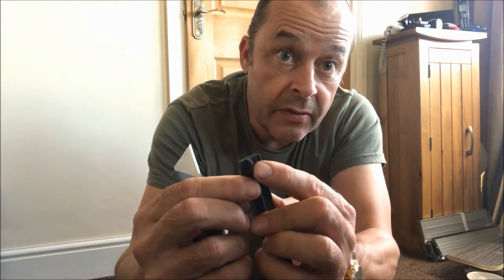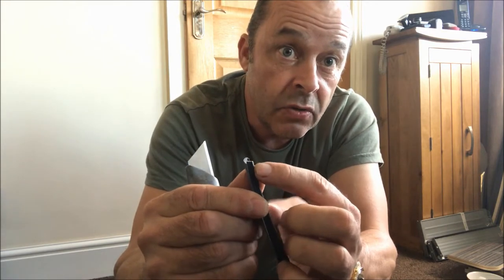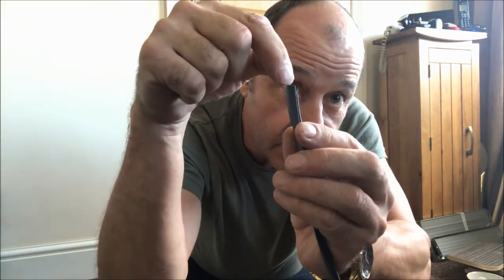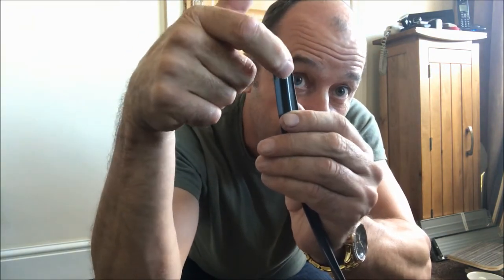What I'm going to do is on the edge that goes into the groove, I'm going to take about four to five millimetres off — cut it off flush. I'll show you in a minute, just do it with a knife — it's quite sharp so watch what you're doing. Right, there you go — you see what I've done there? I've taken about five mills off the edge that goes into the groove, and I'll show you why I do that later. It's just easier to join the two parts together.